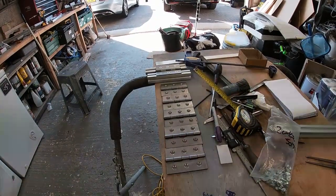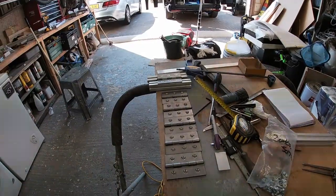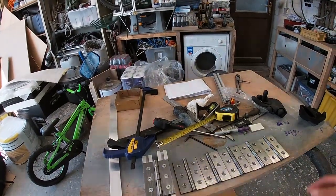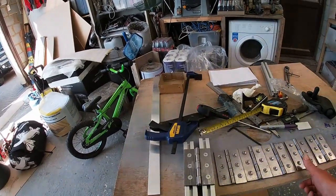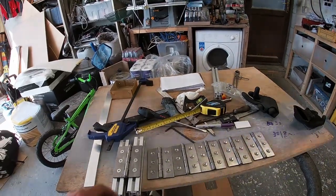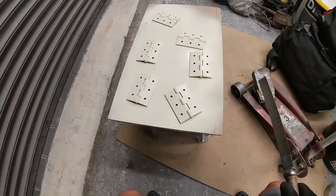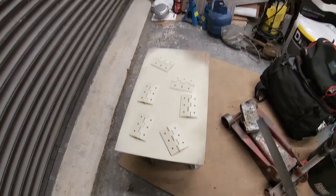All right, that's them drilled in. What we've got to do is paint them now. I was going to buy some pre-made hinges but unfortunately I didn't do the ones I really wanted, so I bought these blanks and drilled them and countersunk them myself. They're proper heavy duty so I don't think we'll break them easy. Etching primer is on, we'll stick them with a bit of silver.